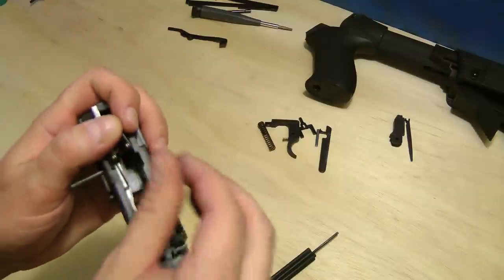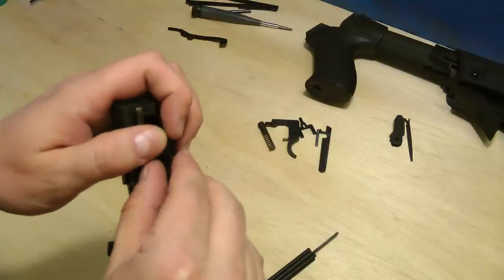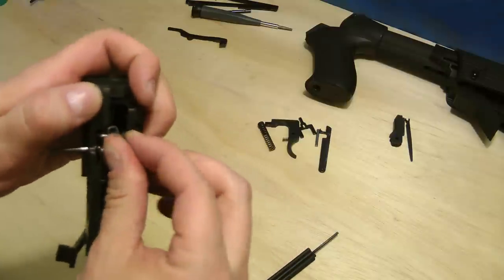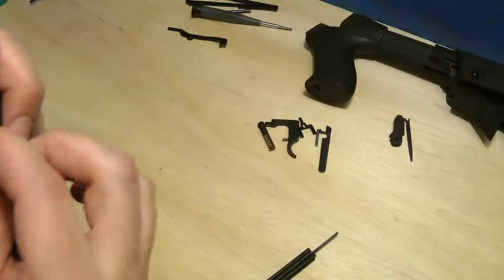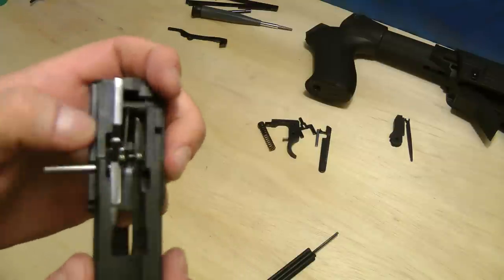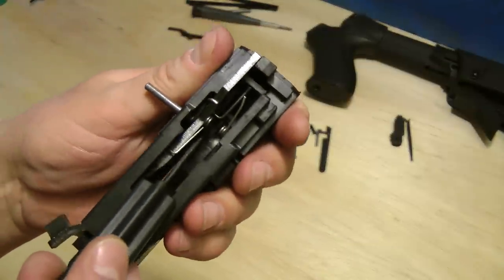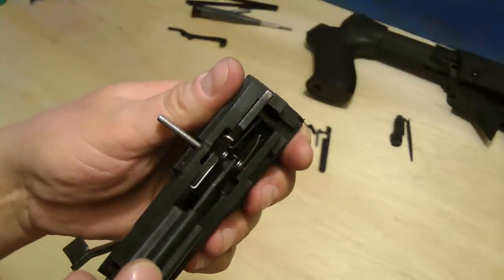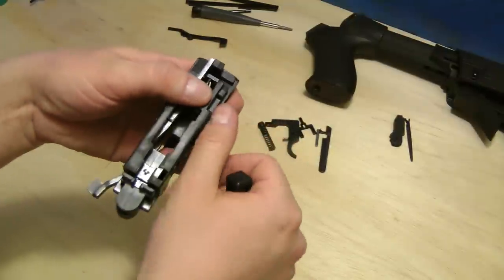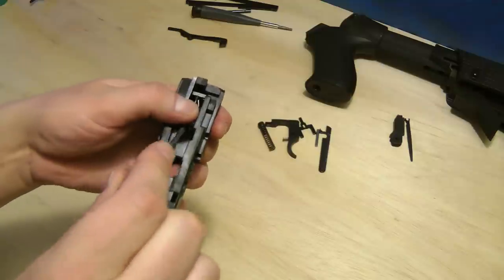So now we've got it like so and this end is sticking in the side. This needs to be squeezed together so they'll go down inside. Get the hook in there, then push the side in — see, now it's in there. What I like to do is put my thumb over the top of the two springs so the thing doesn't go flying out, then go down with my poker and push the spring onto that notch.